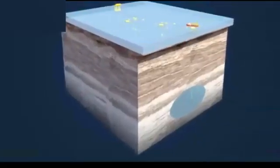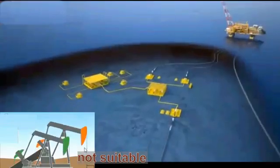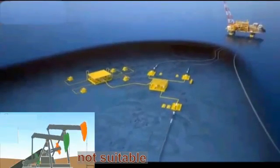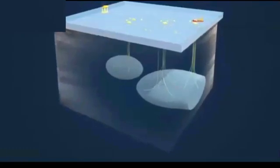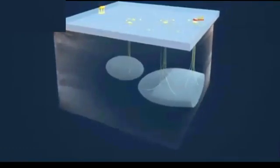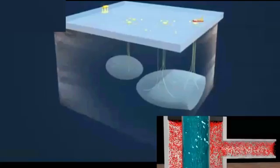Gas lift, on the other hand, is generally used offshore where the sucker rod pumping system is not suitable. It can also be used in wells that are deeper than those that can be serviced by the sucker rod pumping system. Because of its need for repeated maintenance and its dependence on a source of injectable gas, however, gas lift is the second choice for artificial lift.